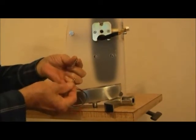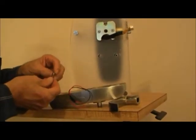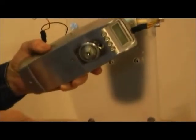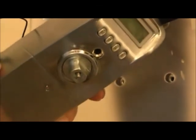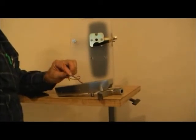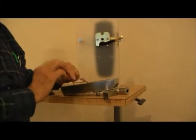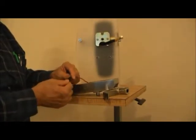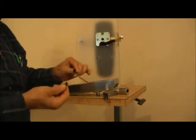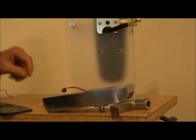In this case, the lock has the spring and the screw held in by a piece of paper. You're going to drop the screw in, then drop the spring in above it. The screw will then come out at the bottom. Next, we have the power connector, which is used to power the lock in addition to the batteries — this is an option for hard-wired power. Since we're going to run this lock on batteries, we're going to remove the pigtail piece. The pigtail piece is only used if you're actually going to wire the lock; otherwise, take it off to make mounting easier.